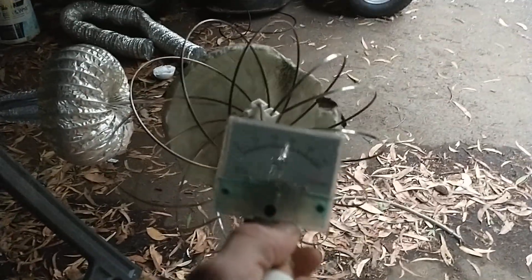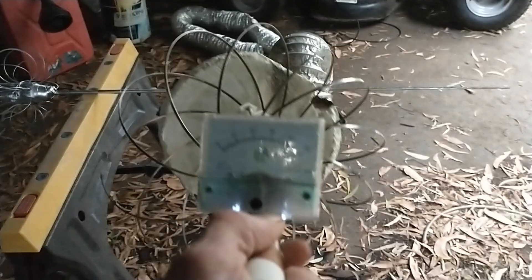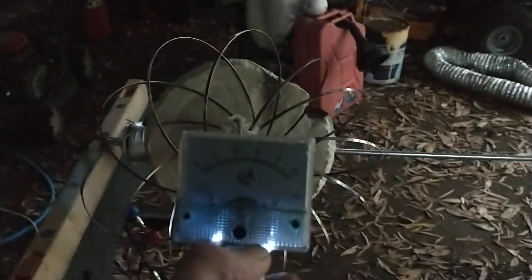Looking on this 50 microamp field-strength meter — this one's also designed to observe in the direction of the E-field vector — I'll come near this torus and come past. This is the hottest section where these two toruses are, and then down to the bottom torus here, and then dead.